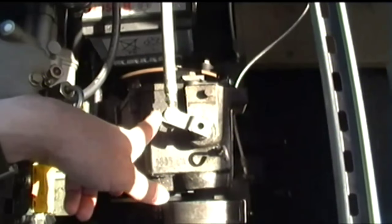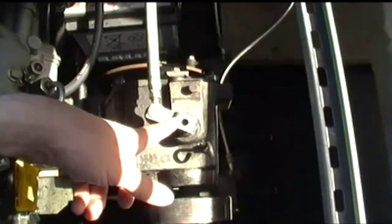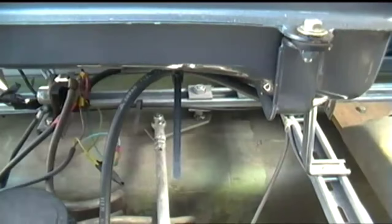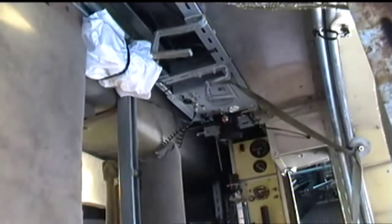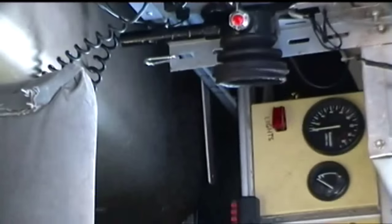This here is the extension for operating the gears that I fitted several years ago when I first converted it to a tank and moved the steering to the other end of the vehicle, so it became rear-engined. You can see basically this comes off the gearbox top, runs to a linkage there. Basically it puts a right angle in, and then it's got a pipe which runs right down the side of the body to a lever, a basic simple lever, which is just sticking out over there.